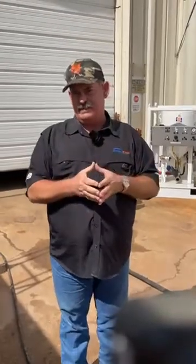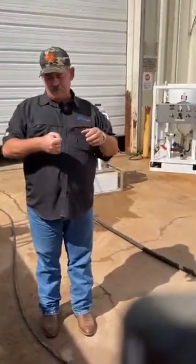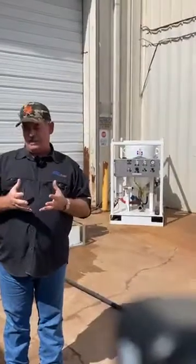I personally had in mind a four or five nozzle at max because I was worried about the thrust on a human's wrist. As we developed and started using it, I'm no longer concerned about that. We're using them today in our blast room where we run a number seven in my big blast room and a number six in the back blast room. The torque on the operator's wrist is not nearly as bad as I had envisioned. I urge you to try them on your larger nozzles and see if your operators prefer them over the lever.